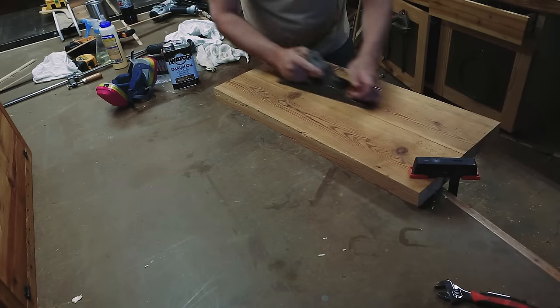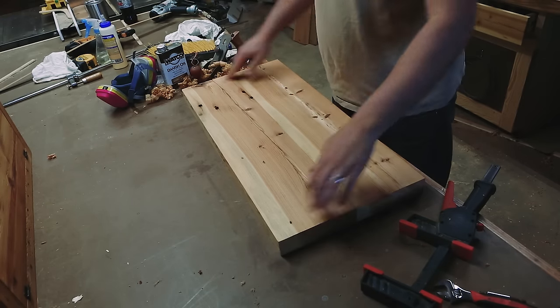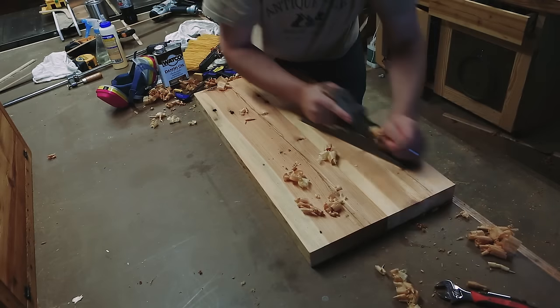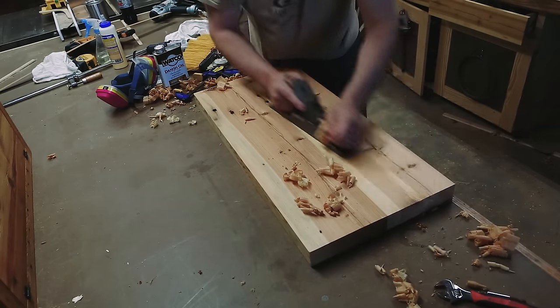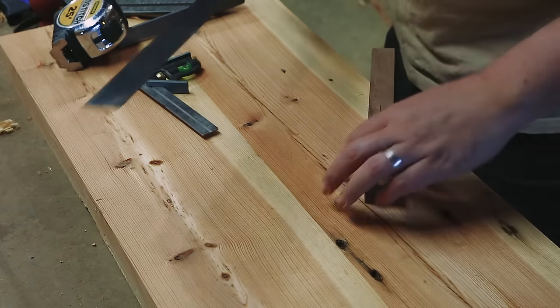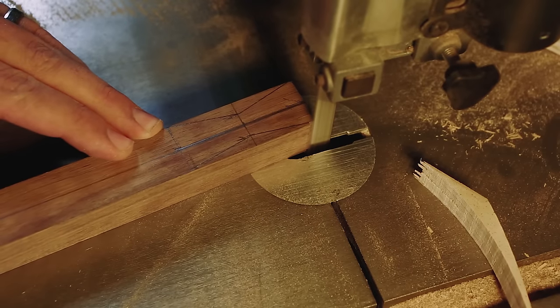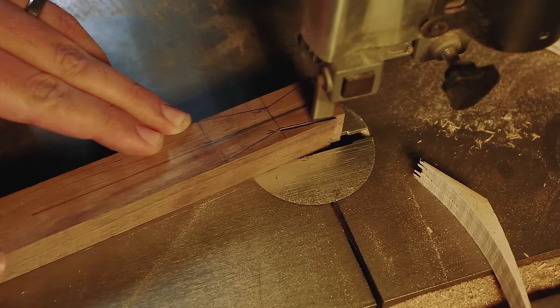There's a little twist to the top and I took care of that with the jack plane. I also cleaned up the glue seam a little bit. There's a check in the top stemming from the pith of the tree, so I decided to stabilize it with some butterflies — I've also heard them referred to as bow ties or Dutchman. I don't care what you call them; the process is pretty much the same.